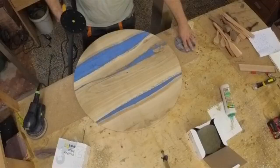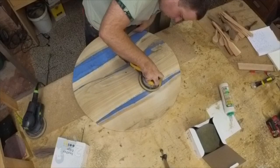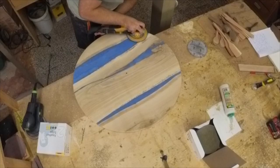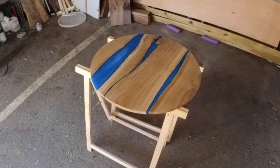When I'm starting to sand with my orbital sander, I like to move one step back. So in the belt sanding process we finished with 150 — now we will start with 120, then progress back to 150, then 200, and 240. Between 200 and 240 I usually pop the grain. And because we will finish with lacquer, is 240 enough?